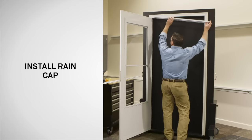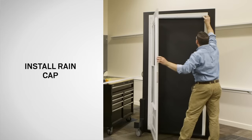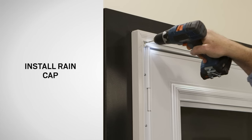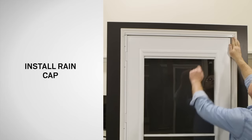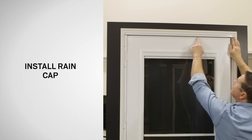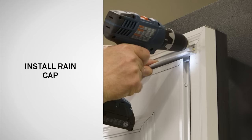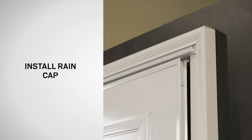Next, install the rain cap. Position the rain cap in the opening so that it rests on top of the hinge rail, aligning the end of the rain cap with the edge of the hinge rail. Close the storm door and position the rain cap so it is even with the hinge rail. Using a drill with the 1/8 inch bit, drill a pilot hole on the hinge side 1 inch deep through the pre-drilled hole in the rain cap, then attach the rain cap using a 1 inch screw from the yellow bag. Position the rain cap so the space between the rain cap and the panel is even across the door. Drill a pilot hole on the handle side and secure the rain cap using a 1 inch screw from the yellow bag.